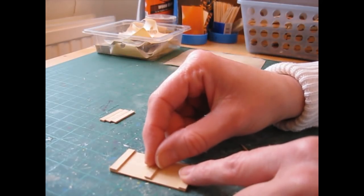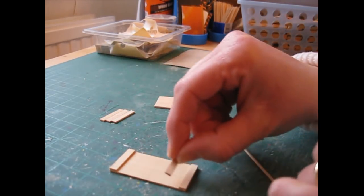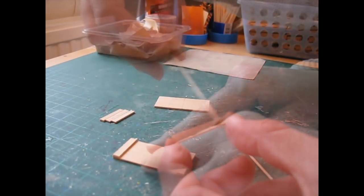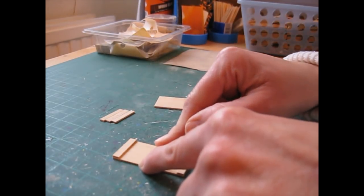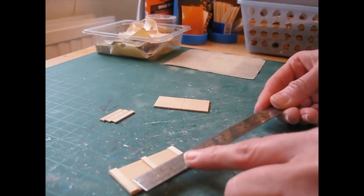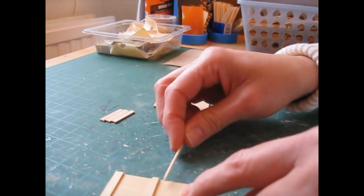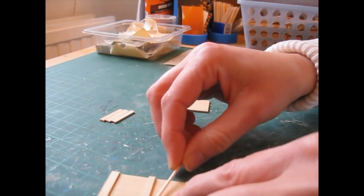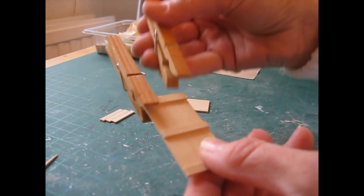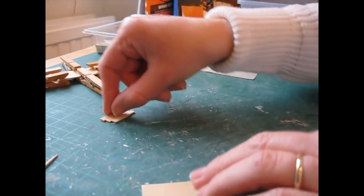This piece we want to place across the middle. I'm going to do that by eye, just making sure that the centre of this moulding is over the top of that pencil mark. But if you want to make a little mark in the centre of the moulding if you're not very good at judging by eye, you can do that now. Make sure it's in the same place at the other side. Before the glue is set, bring your smaller rule in and make sure you've got equal amounts at the top and bottom and at each side — that should be around 20 millimetres, three quarters of an inch. Remove the excess glue, then secure with clothes pegs on each side. That piece can then be left to dry, then repeat with the remaining side piece.